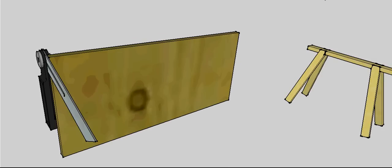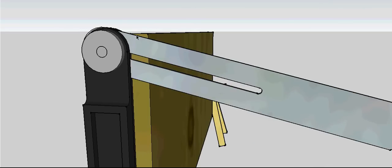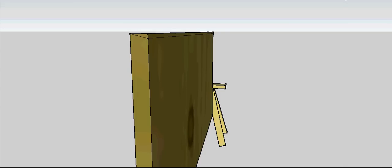So all our legs are attached. We now need to concentrate on our ends. So we grab our little piece of ply. It needs to have that angle that we've been working with taken off this top edge. So we can mark that out, mark a parallel line along this edge and plane that off with a hand plane.